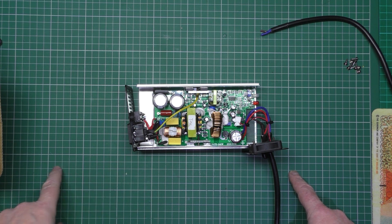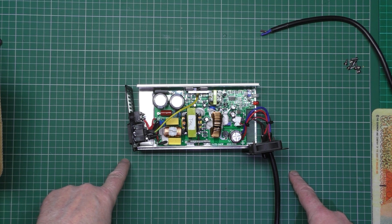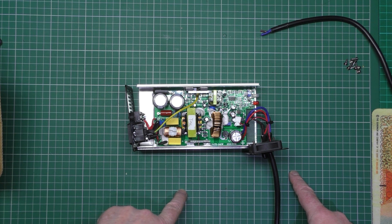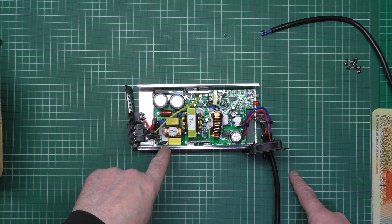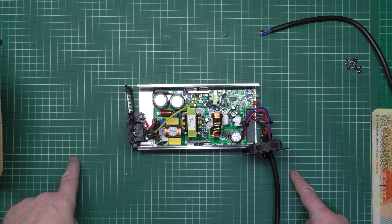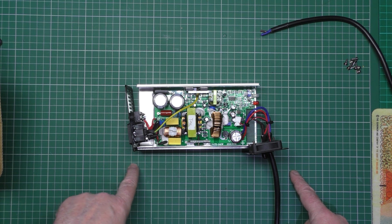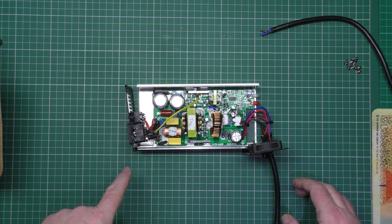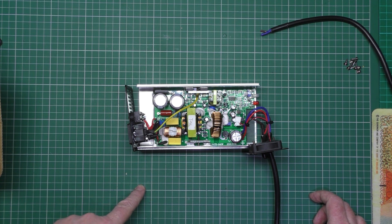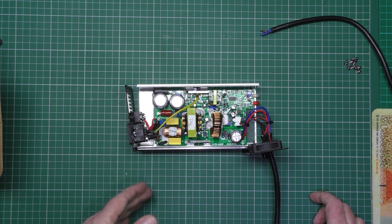What happens is as it's charging the batteries — let's say it's on a peak like that — the current drops off as it starts getting up to its maximum voltage, up to 75.6 volts. I think it cuts off at 75 volts; when the battery gets to 75 volts it'll start dropping off. I'm only going to charge my batteries to 4.1 volts per cell instead of the full 4.2 volts, purely because it prolongs the life of the batteries if you don't charge them fully.